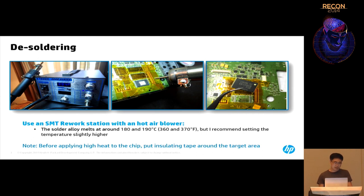You apply heat around the NAND flash chip and pins. During that time, you should put insulating tape around nearby components. I burnt a lot of PCB boards without it. There are a lot of small parts nearby, and if you apply heat around them, they can get blown away and lost. So the insulating tape is really important.